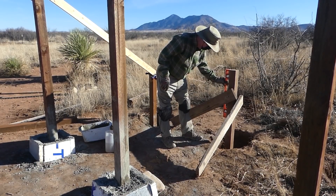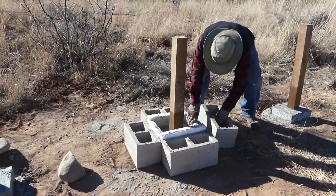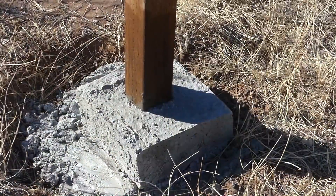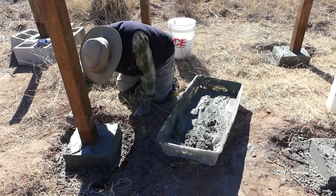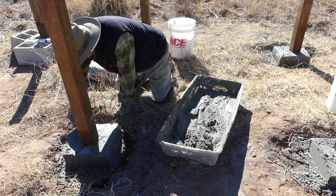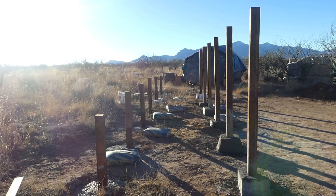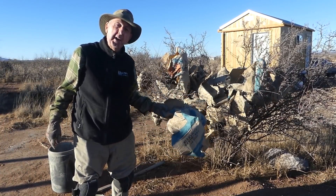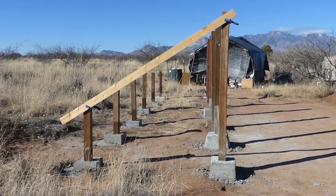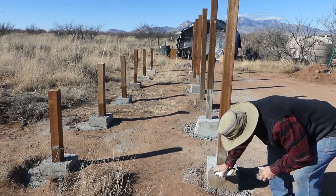While the supports are drying it gives me time to begin on the bottom row of four-by-four posts and do some work on them. Once the cement was dry, these styrofoam forms worked beautifully and things actually turned out okay. Now on cement mix number three — this powder mix is mortar and allows me to just smooth things out. Last bag of the day, using my cement bag desert sumac tree as a great bag holder. They didn't turn out very uniform but extremely sturdy, and that was my goal. I added some paint to make things look better.